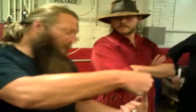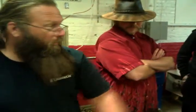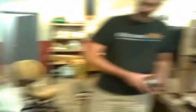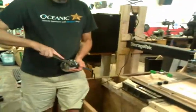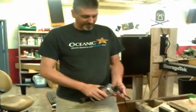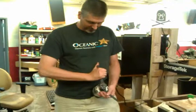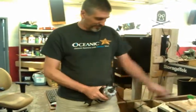Because when you tighten the collet it goes down, it will bottom out and the collet won't actually tighten. So as you're cutting, it'll vibrate and work its way into your wood. If you're doing a light pass, next thing you know you're going through the table — doing a deeper and deeper pass. It's also going to loosen up the bit, drag, and you'll probably end up going through the table.